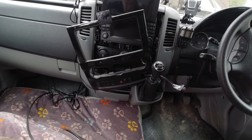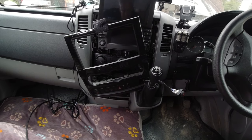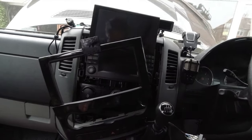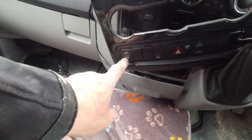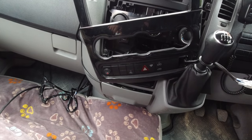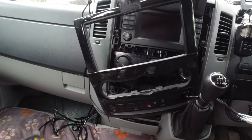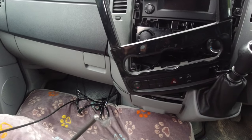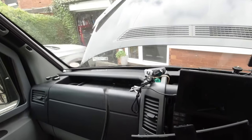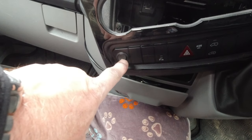No, we haven't had an accident. I've decided to fit some reversing lights, and I didn't want to do it the simple way by linking them to the reversing lights at the back. I wanted a separate switch here so I can switch them on and off from the dash, because the reversing lights were a bit bright to use on the road — probably just for wild camping. So I've gone through the process of putting this cable, a quite thick core cable with good covering, the full length of the chassis through the bonnet, through the wiring harness, and into here. I've drilled a hole here and fitted this little switch.